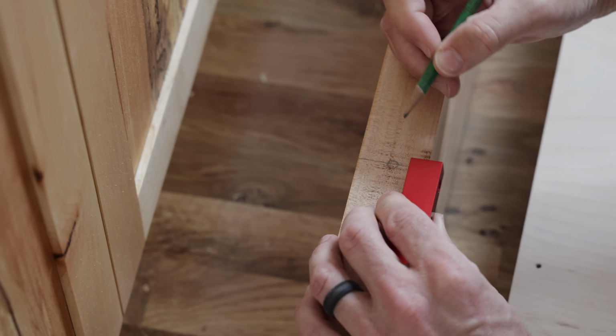All right, we're not going to drill with our jig. We're going to drill with the dowel jig because this is going to give us perfectly centered holes. All right, and you should be able to tell that the line that I transferred is centered on that hole. After you use your dowel jig, drill out the holes to the rest of their depth. It's actually easier to put the rods into the shelf first because this is hardwood, whereas the studs are softwood, and it kind of bends a little as it goes in.